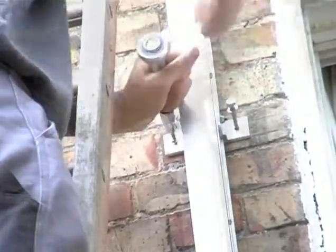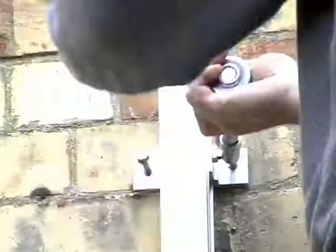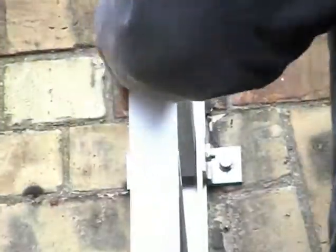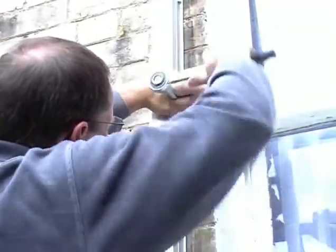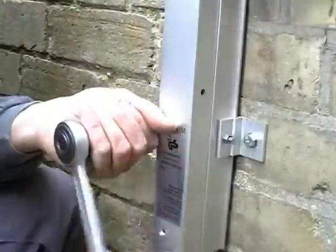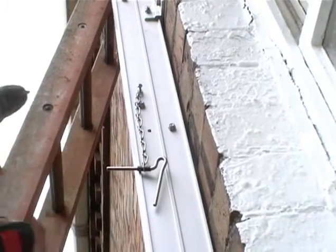You then screw the screws into the wall. When both screws of each bracket are fixed into the wall, tighten them again well. After the screws of each bracket are fixed, open the ladder to see if the ladder opens smoothly. If the wall is curved, the movement of the ladder might become stiff. In this case, distance pieces might have to be fitted behind the wall brackets. We supply some of these with the ladder. Should you require additional distance pieces, please ring your dealer.